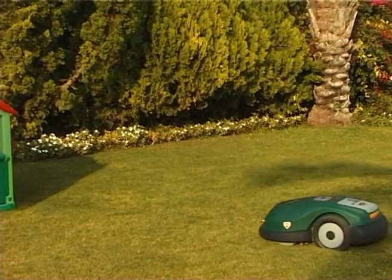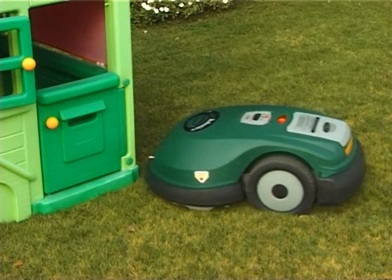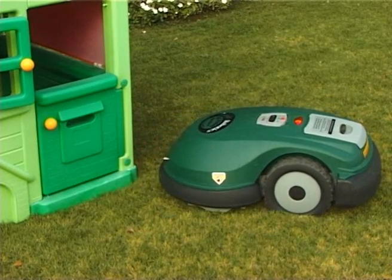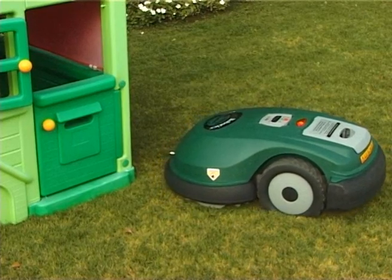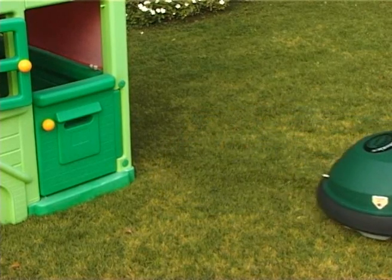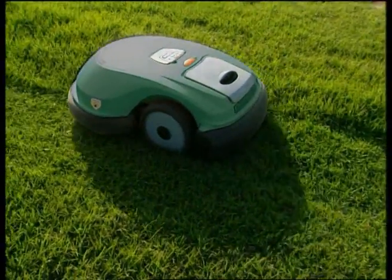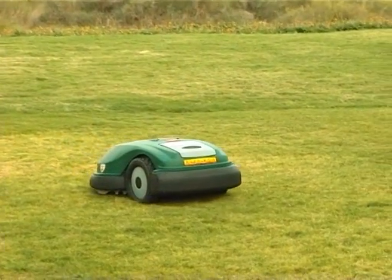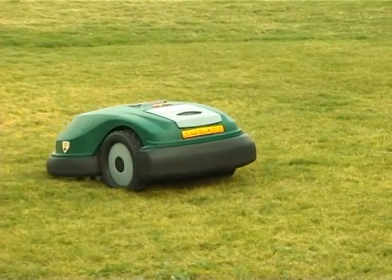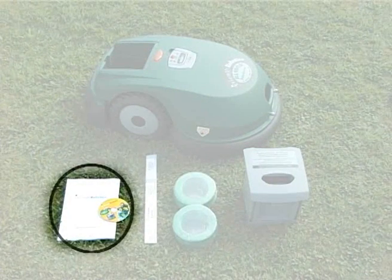The perimeter wire set around a tree's flower bed as a perimeter island will stop Robomower from entering that area. The Robomower will mow around all kinds of obstacles, since it changes the triangular direction whenever it hits a side perimeter wire. Firm objects will be recognized by the bumpers and do not need to be placed within perimeter islands. The Robomower will continue doing sets of triangles in different directions until the end of its designated work time. Good-looking lawns are achieved by operating the Robomower frequently. There are various other advanced features; please refer to your operating and safety manual for additional information.